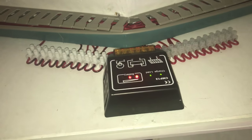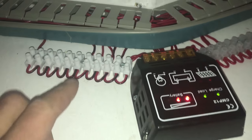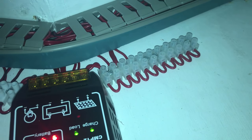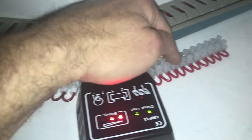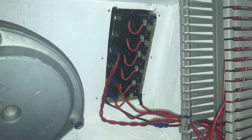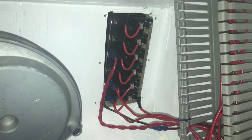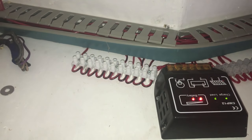This is my voltage regulator going to the solar panel, charging my batteries. On this end I've got all the negative connections and on that end the positive connections, so I'll be getting a negative from here. I've got a positive connecting from there to the switch at the bottom — all those switches are just live connections. The other leg of the LED will then be plugging in there, getting positive from the switch and negative from the connector block.